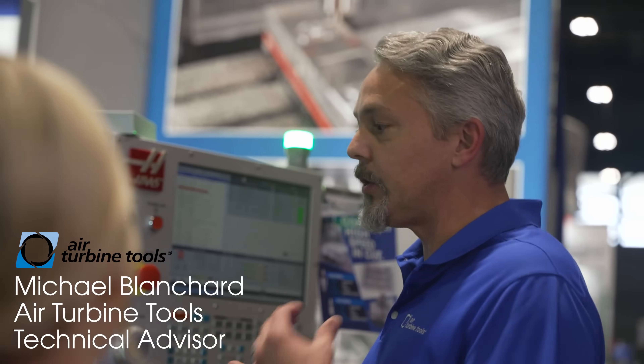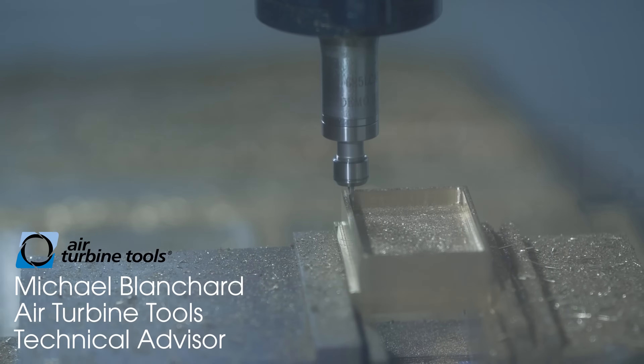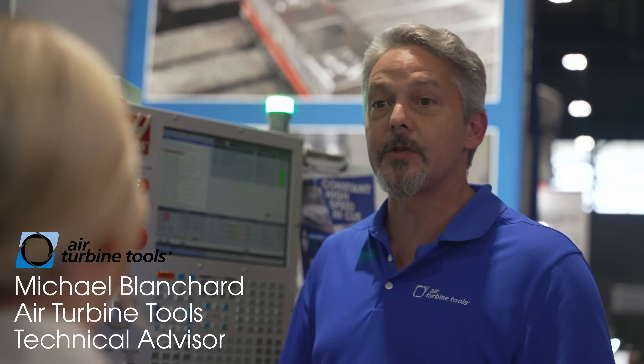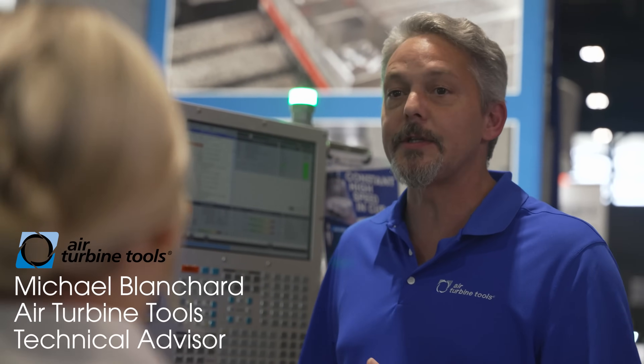Today we're making a chocolate mold. We can come in and rough out with the main spindle, then bring one of ours in to do all of the finish operations at 40 to 50,000 rpm, which allows us to get up to speeds and feeds around 160 inches per minute.